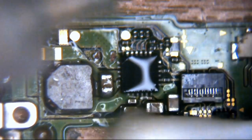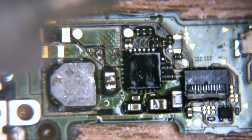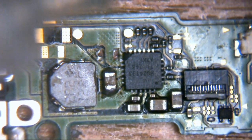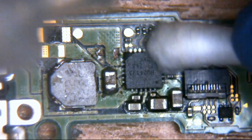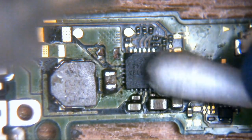Now, here's a quick word of warning for you, because obviously somebody's lost that capacitor there previously, which is a bit of a problem. But what I will say is, if you are going to do this work yourself and you find there is something amiss around this little IC here, this BQ24193, the little charging controller IC, if you are going to remove that,